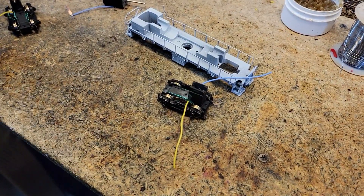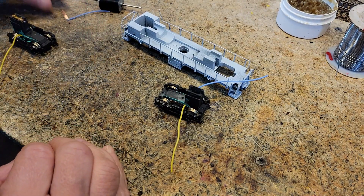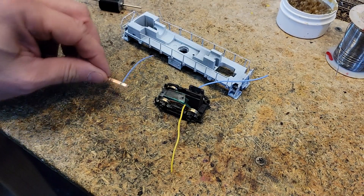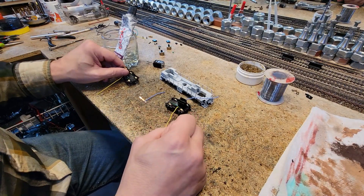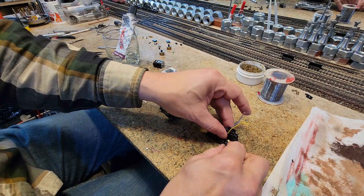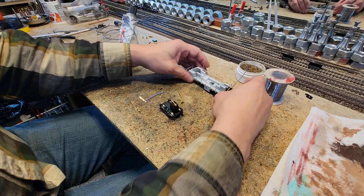We've got no wipers. The gear towers are metal, so the green stuff you see there is liquid electrical tape. What I did was cut some copper strip from copper sheet and soldered on the lead. Fortunately, our favorite stuff here — goop — is an insulator; it's not conductive. I figured out that these leads need to come up right alongside here in order to come up through this hole, and I milled the hole out just a little bit to make sure it'll go through.